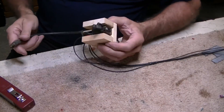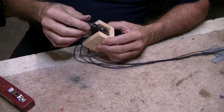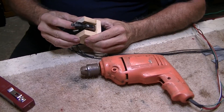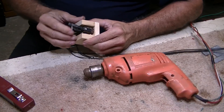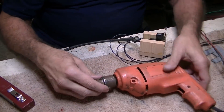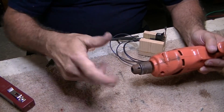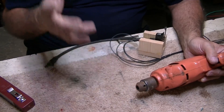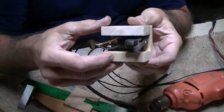I'll give it a test - yes, I know this is 110 voltage, so you've got to be careful and know what you're doing. I press it and it goes one way, flip the switch and it goes the other way. It does work! Now it's going really fast and there's no variable speed - that's going to be a problem. I can solve it by putting a tiny spindle on here; the drill will turn fast but because it's a tiny spindle it'll wind slowly. If I have to run it through a pulley system, I'll do that.